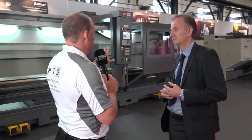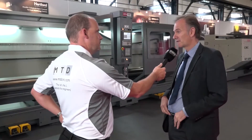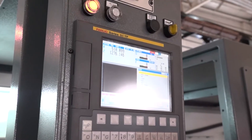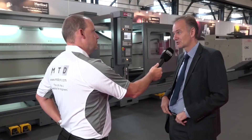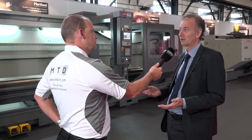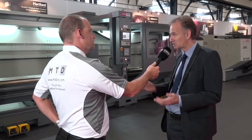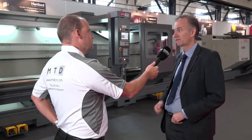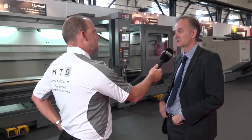Final point — the control on this is a FANUC system. Is that the only option? Not at all. FANUC is probably the most popular option for a machine of this type. You can also have Siemens controls as an alternative, if that's your preference. And of course, being a Spanish manufacturer, the Spanish market in particular really does favour the Fagor control. And with any of these machines, are there teach functions? There are basic teach functions with the machines and manual guide options available as well.